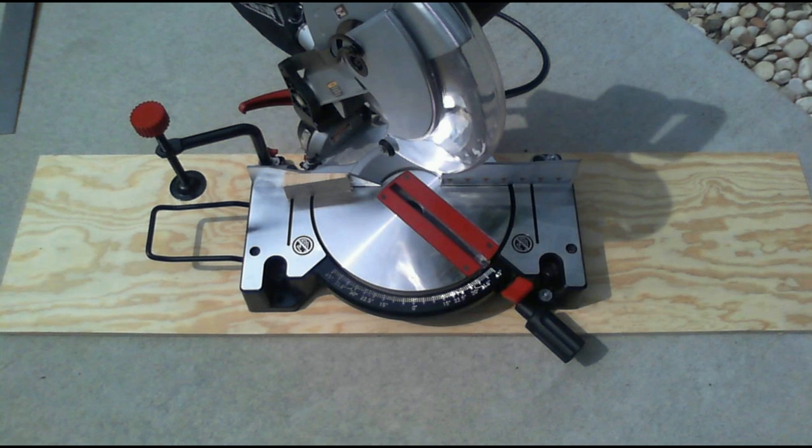We'll go over the tools that I used to build the trommel. This miter saw comes standard with a carbide blade, and you can use carbide blades to cut aluminum stock. I'm using aluminum for the braces for the trommel frame. It also has a laser light — which is not showing up here — but it shows where the blade will cut into your lumber or aluminum stock.